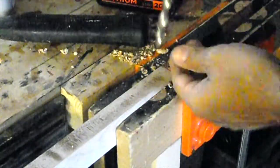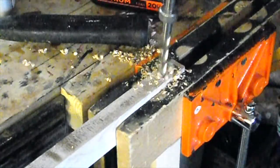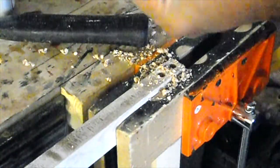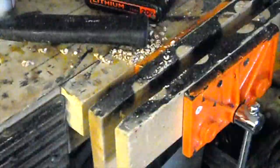What I'm doing here is reinforcing the door with screws. I put together the door — it's glued — and now I'm drilling out some holes to ensure it's going to be a pretty solid door. I'll add these extra screws and then fill them in with some dowels.